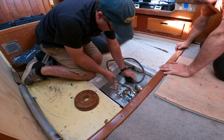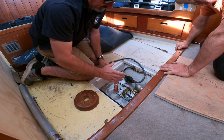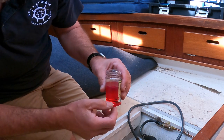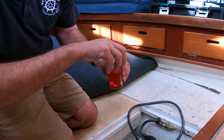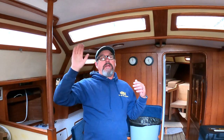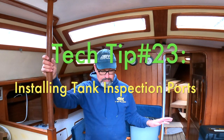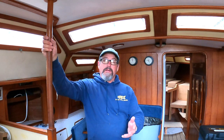I'm using a small container here since we have brand new fuel, but normally you'd use a liter bottle with a top on it to pull your sample. You pull your fuel out, let it sit, and if you have any water or contaminants they'll show up — like Italian dressing separating. A perfect fuel system starts with a clean system. If you've got a used boat, I'd recommend opening up the tanks and getting them clean. You'll also want to add a little biocide to the diesel fuel whenever you fill up.